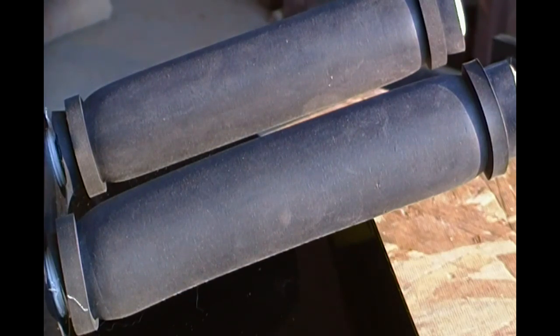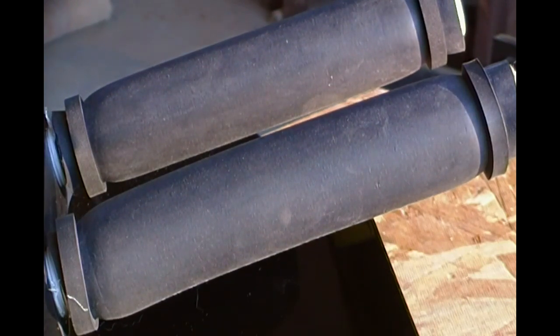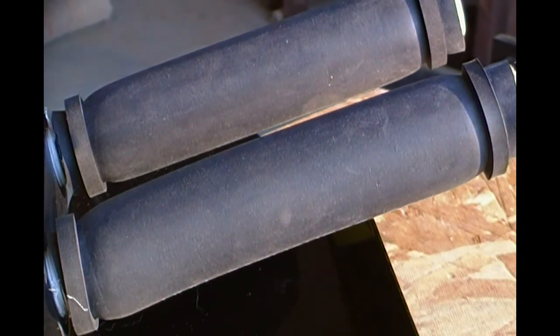So we're in the bottom of the pond, and maybe we do get some sort of biological growth on the diffuser. Notice that your boil is getting smaller. So what you'll do is just simply turn off your aerator, let it collapse, turn it back on. Do this a few times to help break it off. The other option is just leave the aerator running, then go with the diffusers in the water and just slightly rub over them, and they will release.